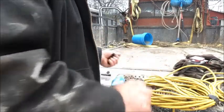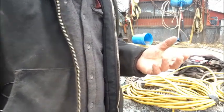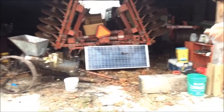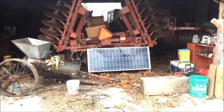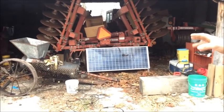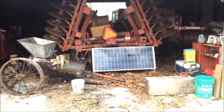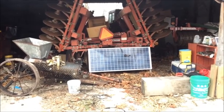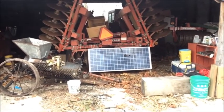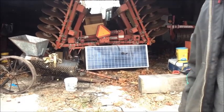I'm going to go over there, hook this up, and test what the batteries are right now. As you can see, it's a sunny day. This ideally should be outside a little bit farther, but I don't want it to get damaged. It's a 120-watt panel — it's going to trickle charge those batteries over a period of time and give them plenty of charge. Even on a cloudy day, I think that's a 7 or 10-amp panel. In a couple of days, on a couple of big 6-volt batteries, it'll have them fully charged, no problem.